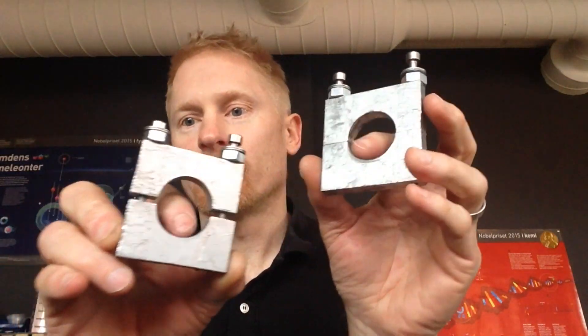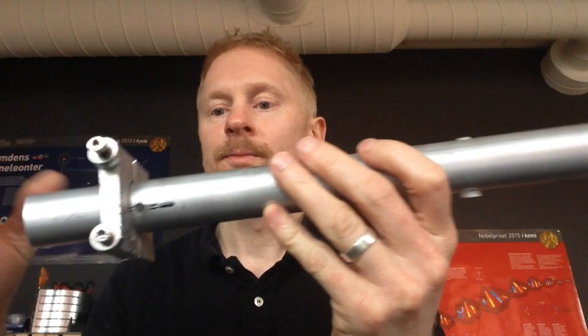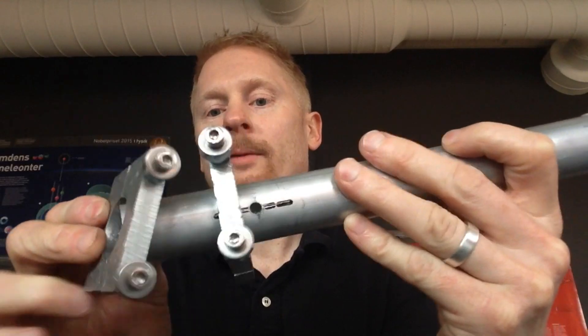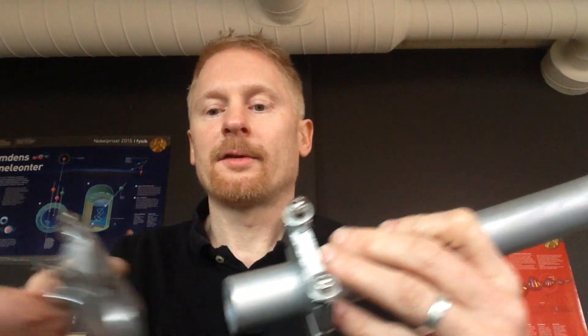This tool is also a simple one. It fits onto the 30mm tube that makes up the propulsion parts of the multirotor. It's simply clamped onto each side of the two parts and you can fasten them in a vise and push the two separate parts together with the intersecting connecting part in the middle. Because you need a pretty good fit on the parts, there will be a lot of friction when you push them together, especially since I have bent the tube already so it's not perfectly circular anymore. These simple parts are also super useful when doing that job.